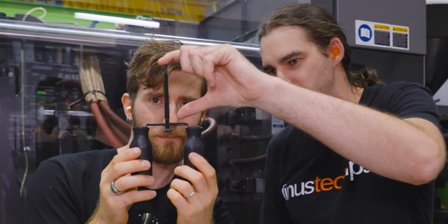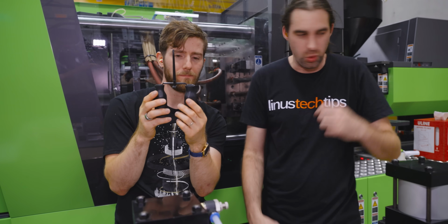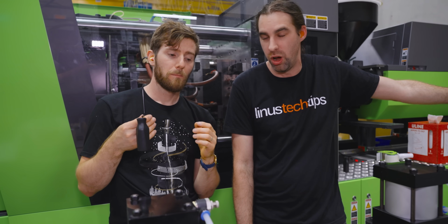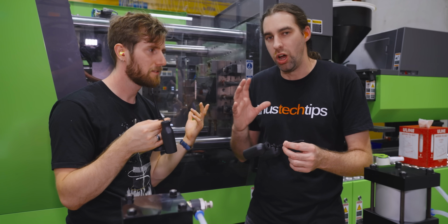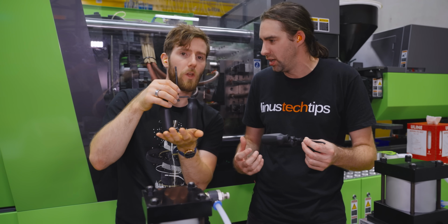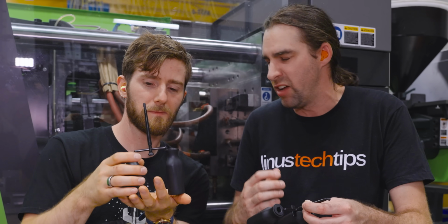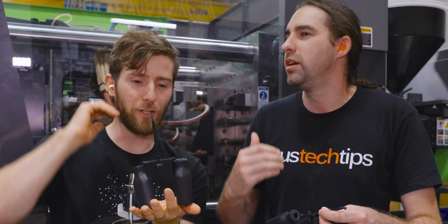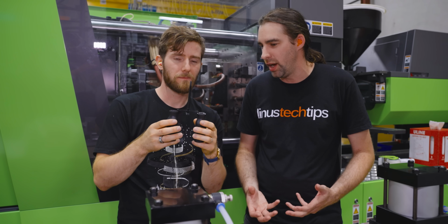Unfortunately, well, they're not lost, because we cut these off and we regrind them to add to the pellet stuff that we just got earlier. But you can only have so much percentage of regrind. You have to have some virgin material going in. So what are we going to get away with? Like 10, 20%? It depends on the part, but for most of the outer components, it's 25%. Got it. So what we want to aim for is that the sprue and the runners are under 25% of the total shot, so that we have basically no waste. Exactly. We don't always get it, but we try.